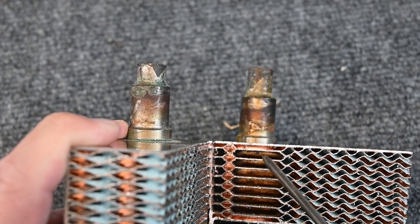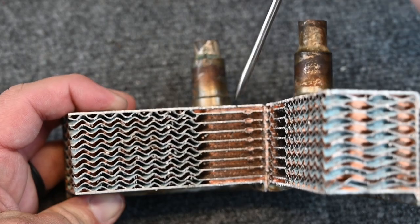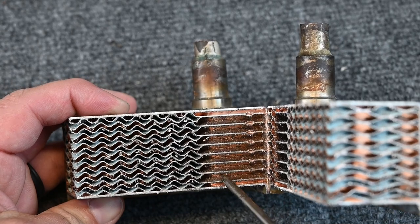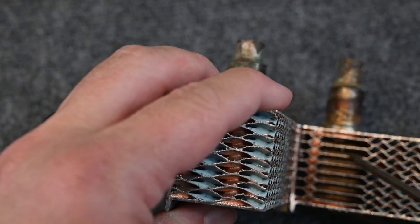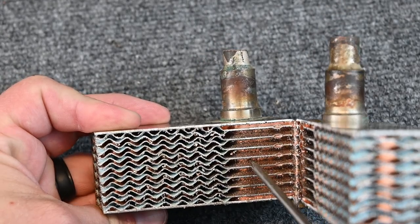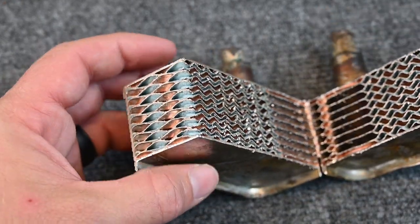So these chambers here are lined up for the refrigerant side, they just go back and forth. This one's on a different set of chambers, so when I put the tool in here, you can't see it. So these are going on the outside. So here's the refrigerant running in this section, and since this is sealed, the glycol is running in a separate set of tubes. Let's look at this a little different way, because that can still be a bit complicated.